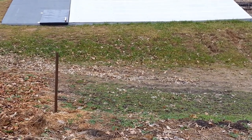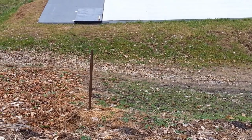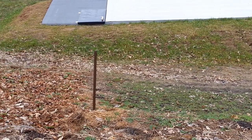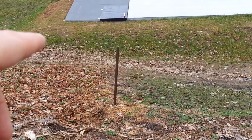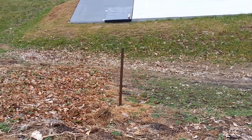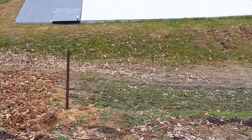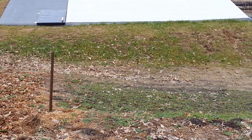But the idea is that with this system, what did we do? We added around the perimeter walls. The problem with the walls in an earth ground system is the rain comes down in the fall and goes into the ground. And then that's where you have this frost line — goes as much as deep as the water goes. So then you would have basically frozen walls to contend with. Those who have done these earth ground systems have ended up having to insulate their walls, and the walls aren't contributing to the heat, which is what you want.